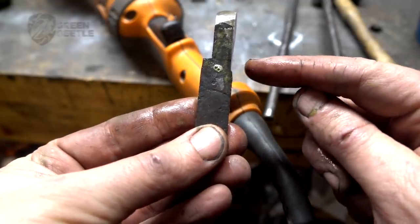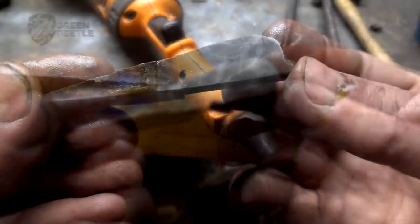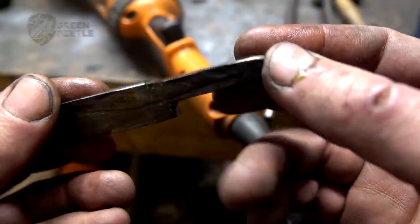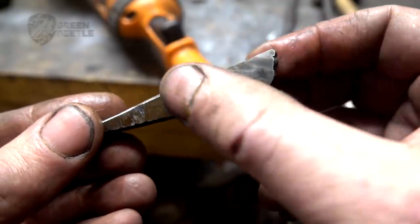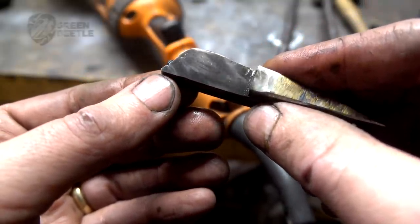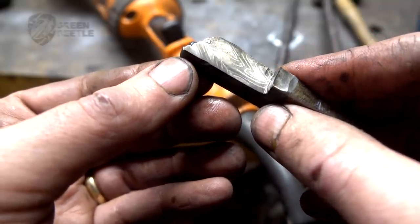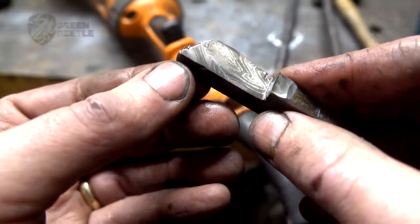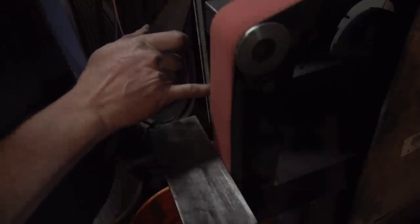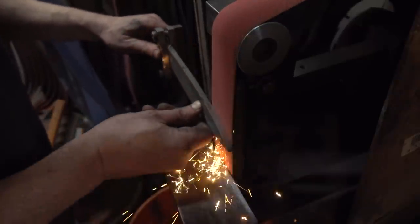We want something between the second and the third diagram. Here's the piece we cut off the tip to form our clip point - I've ground just a little ways into the right side and you can see that candy cane appearance. I've ground further, probably 30 to 40 percent into the left side, and you can see loops and cool swirls starting to form - that's sort of what we're after. The problem of course is will we be able to grind far enough into our knife to see that pattern. It's sort of thin right now and we don't have a lot of extra material to get rid of.